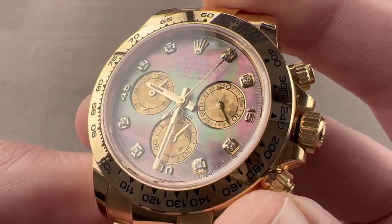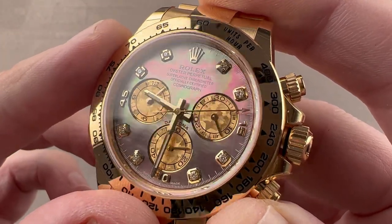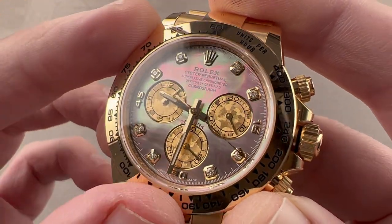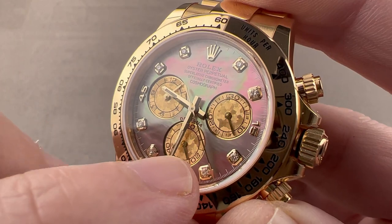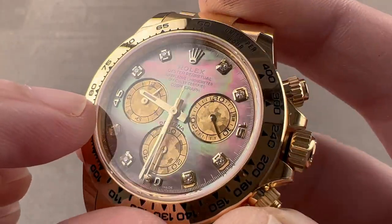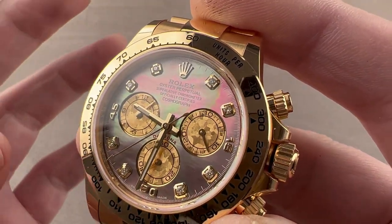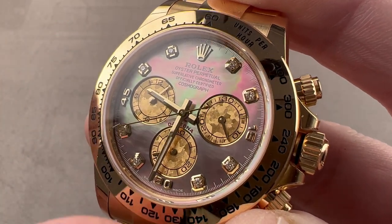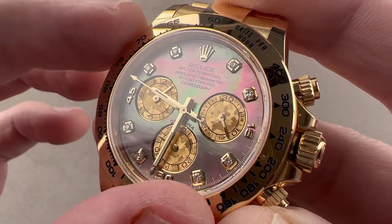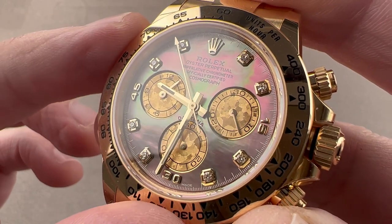Taking a quick look at the dial, it is black mother of pearl. Black mother of pearl creates the impression of something much darker in the mind's eye, but the reality is it has an extravagant, almost holographic rainbow spectrum and an apparent depth almost like the chatoyancy of French polish. The sub-registers are a Widmanstätten pattern oxidized meteorite that have been yellow gold gilded. Each one has a polished gold chaptering. We have yellow gold hands, yellow gold indices, and a yellow gold Rolex crown — all 18 karat to prevent oxidizing or tarnishing. We have brilliant-cut diamonds, laser matched for the same color and clarity, and they are set by hand, something all too rare in modern Rolex watchmaking.